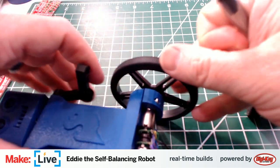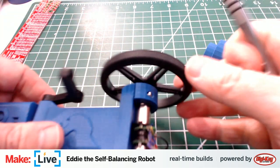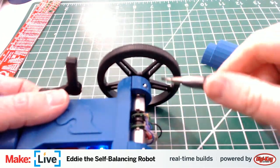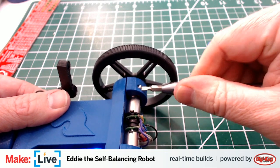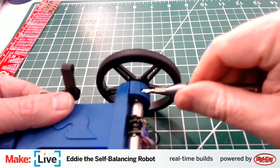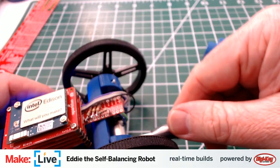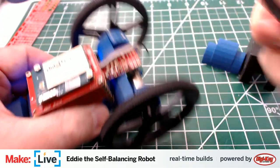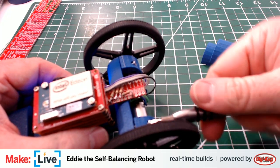It's definitely a hardware issue. Because I definitely feel like the motor is engaged. When the motors don't have any power going to them, you can actually turn them pretty easily by hand. In fact, one of the first things we're going to do is, make sure I have enough slack here. So I should probably just detach the motor entirely.